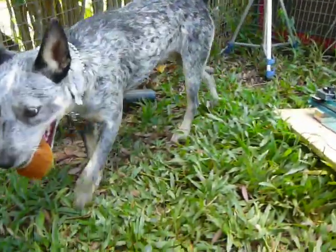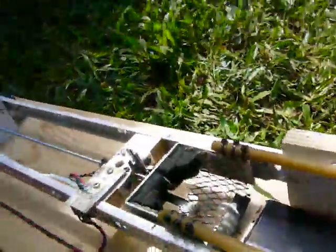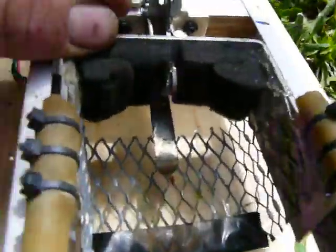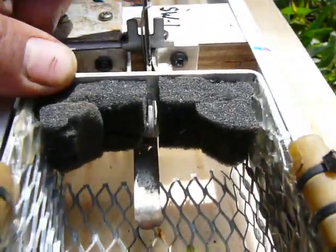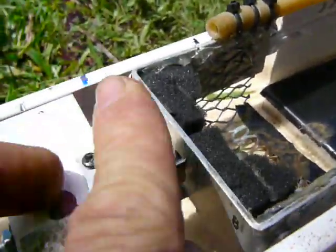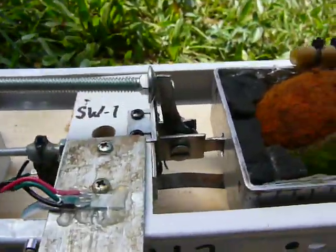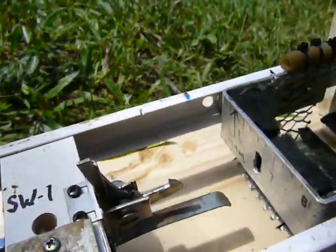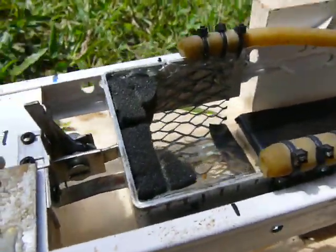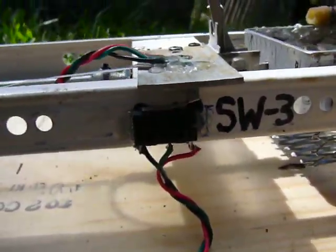Sophie's a bit of a glitch in the system, but we're working on it. Here's the little catch mechanism that grabs and holds on to the sled. Put the ball in again — watch what happens. This is going to bump into the carriage bolt, lets it go, then the ball switch goes back to neutral and the carriage comes back up and clicks into engagement.